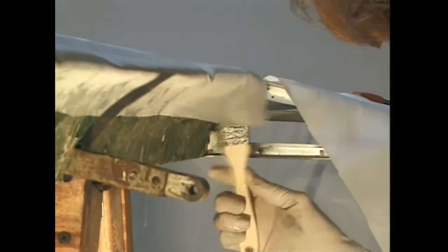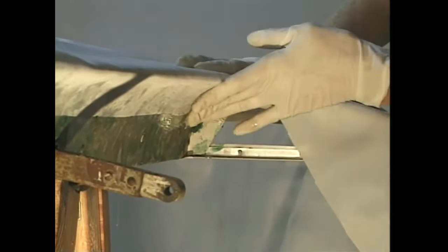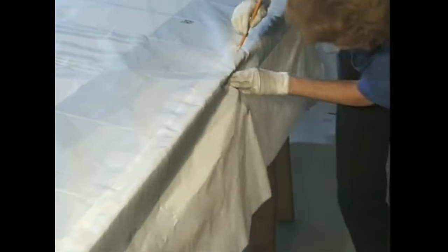Adhering to this rule, the fabric will be cemented into the aileron well at least 1 inch. More is okay, but not necessary. Draw a line on the fabric so that at least 1 inch extends into the aileron well. Use only a number 2 pencil to mark the fabric. Anything else may bleed through to the final finish. Cut on the line and cement the fabric into the well.